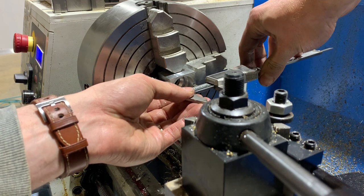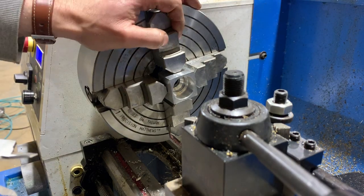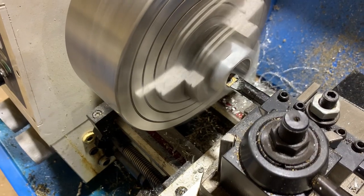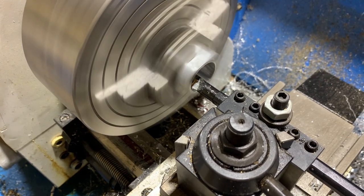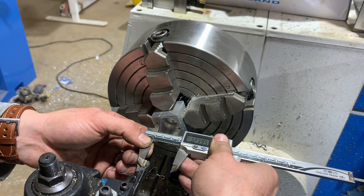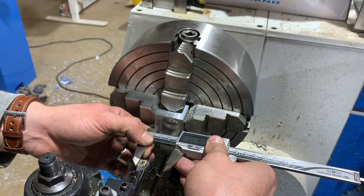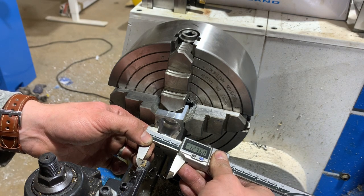It's hard to, anyway. I think another 10 thou, which is 5 thou on the dial, should get us pretty close. It should be 1.24 everywhere. I'm just doing this to double check measurement error, which, as you can see, is a couple of thou.